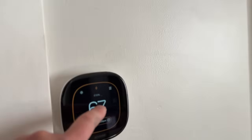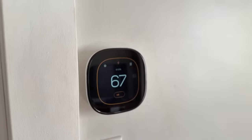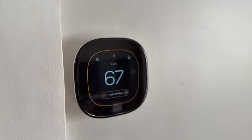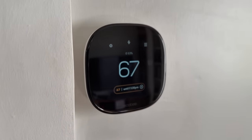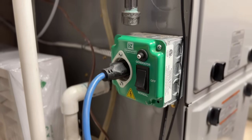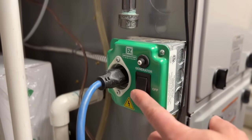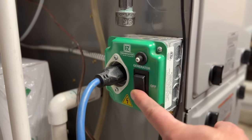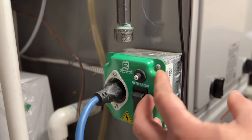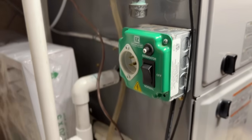We've proved that this works flawlessly. We're going to bump this back down to 68 or 67 degrees so it will kick off, let that cycle off, and then show you how to do this in reverse to go back to grid power. Our furnace has had some time to cool off — very straightforward to go back to grid power. All we're going to do is go to the off position and then over to normal. As long as we have grid power, we'll then be powering our gas furnace via the grid, and we can just unplug this and store it.